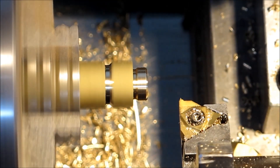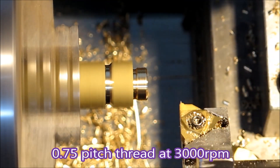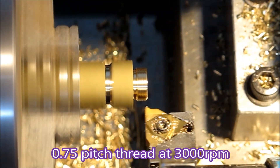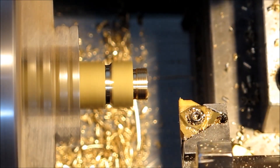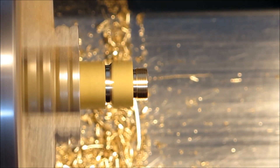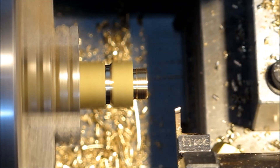There we are, cutting a thread at 3000 rpm. I used to think that shaking was when I had the leg of a tripod hitting the lathe, but it's not — it's the lathe itself. It shakes like that when you've got the feed threading so quickly.